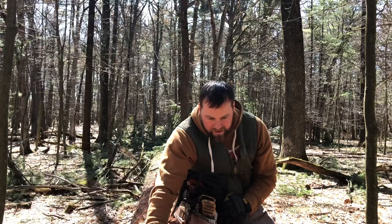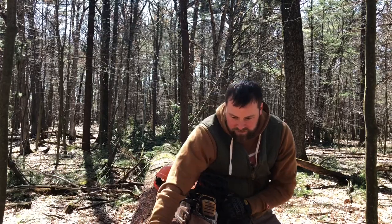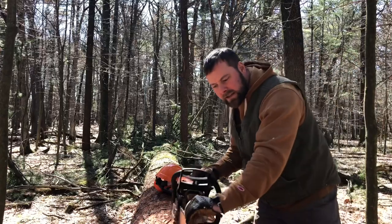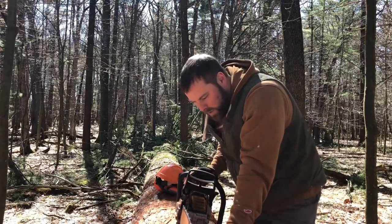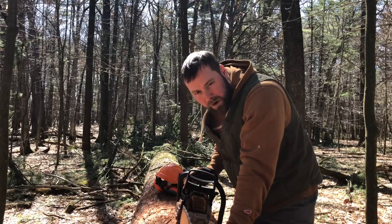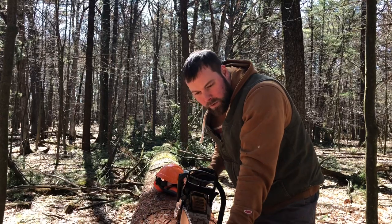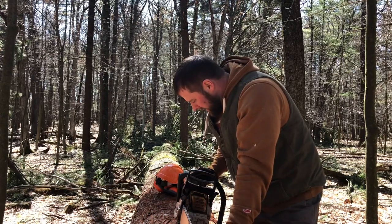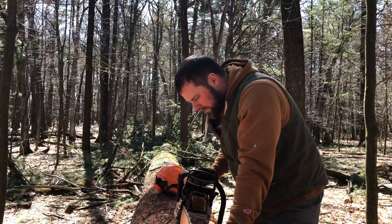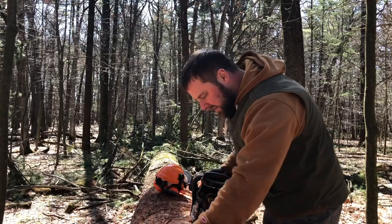And not only that, this would take a ton of gas to finish this up. I mean, I've been at it for about 5 minutes. Now, granted, maybe there's a trick to it. I don't know. But to me, just a little sweat and hard work peeling it with a floor scraper seems to go a lot quicker. It looks nicer when I'm done. And it does a better job because there's a lot of spots where this is missing and I have to hit it again and stuff.